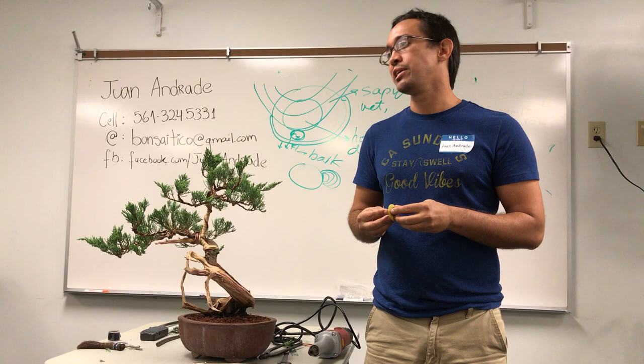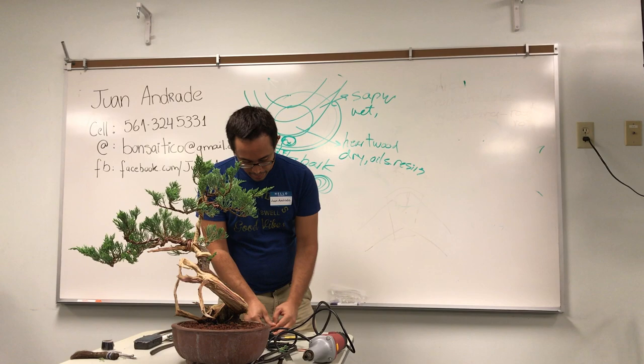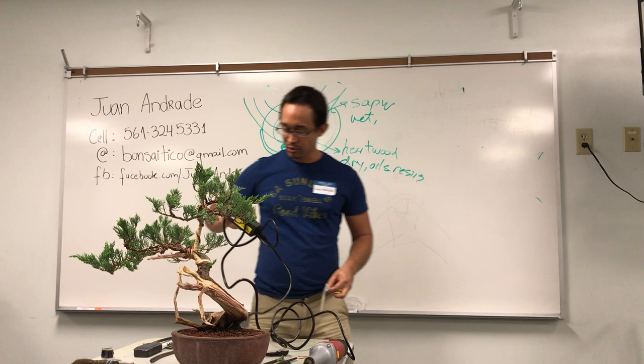So the trick here is you don't want to run them too fast because they will burn rather than just sand the wood. So you want to use a speed regulator for the die grinder. You can also get this at Harbor Freight. I'm not sponsored by them.